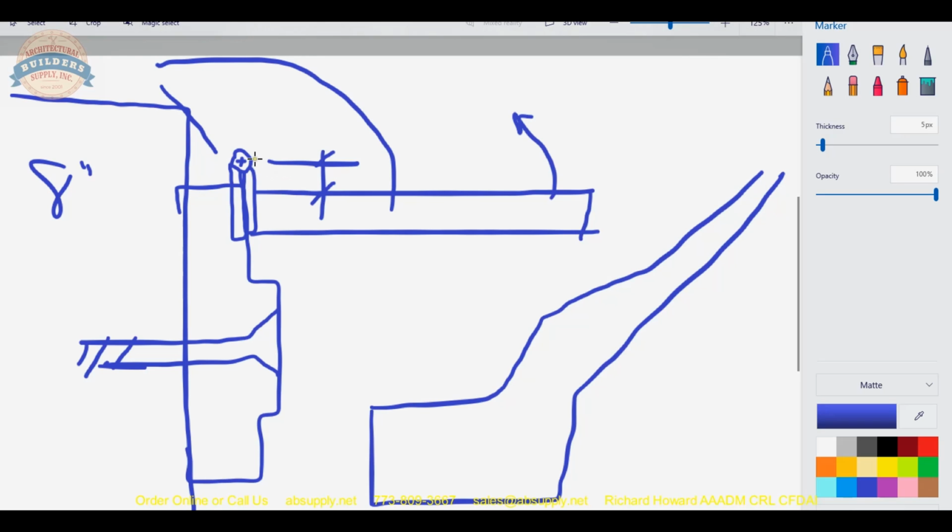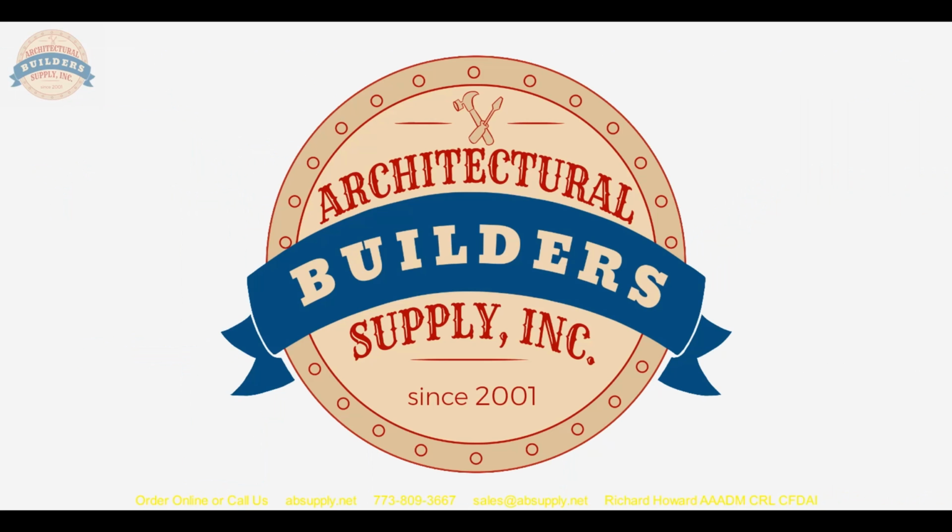Now, I'm not saying that you should consider wide throw hinges. What I would be saying is you should put an overhead stop in that scenario. But the point of the matter is thinking about where this dimension lies is truly the moral of the story. If it's wrapping the wall, 4-inch ought to be perfect. If it's otherwise, 4.5 is probably perfect, but it could probably be better as well.